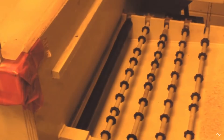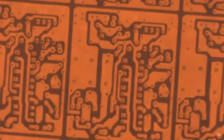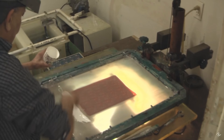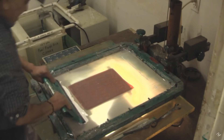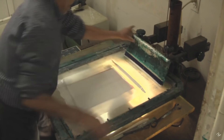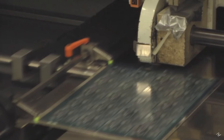This is a negative process for these double-sided boards because it's plated-through holes — the negative resist is used, and then this board will go to an electroplating bath which will plate on the tin where the copper is going to remain. Just being able to mix printing ink the right way and get it to the right consistency — with the thinner and the retarders and everything mixed just right — is like an art in itself. Having just the right touch to screen the ink through in just the right amount and pressure — it really is a very fine art. And there we go, one printed board. To break the boards out of the panel for soldering and assembly work.